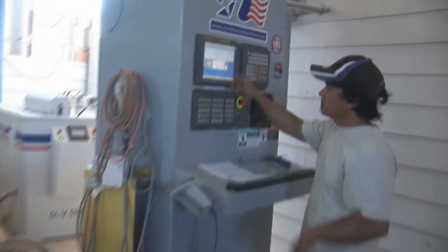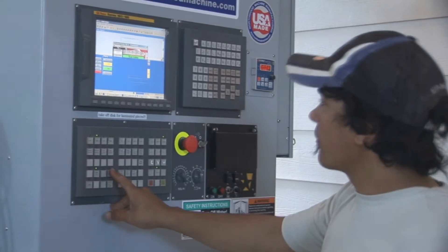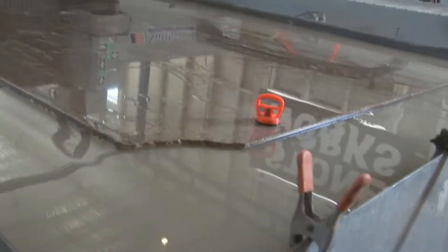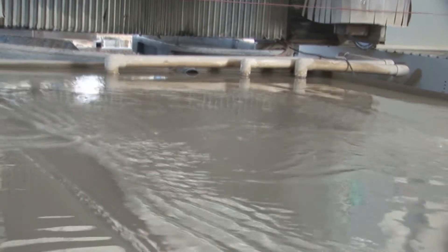You've got to love it. This is a stone worker's dream. So now he's going to go ahead and hit the float tank button, scan in the barcode, bring the program up, and now he's going to raise the tank. Now you can see the water come up — this is done with the ballast underneath the tank. The part gets submersed and the cutting procedure begins.